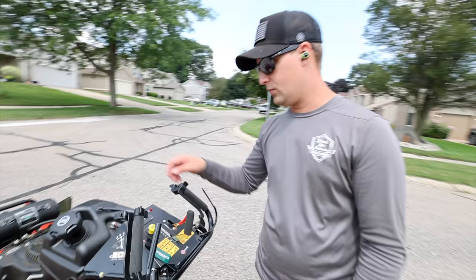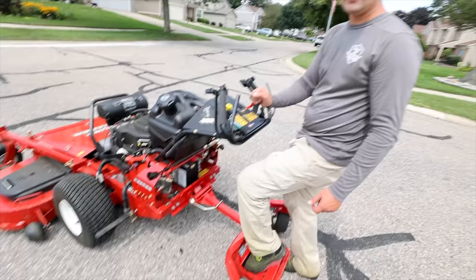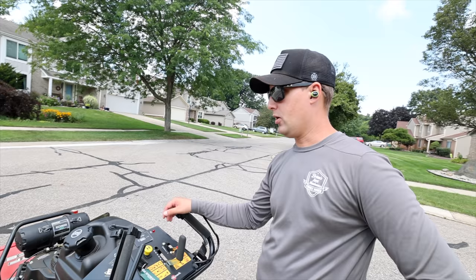Just to recap: you've got your ignition, your PTO, and your gear drive. If it's a gear drive not a hydro you might have to knock it with your knee on the old school ones. You've got your throttle, your hour meter, and your parking brake — that's pretty much all you need to know for a walk-behind mower. If you want to see our video on how to operate stand-ons or zero turns, I'll leave a card and a link in the description. Thanks for watching!